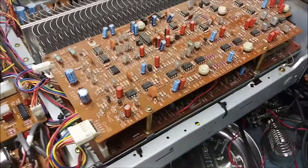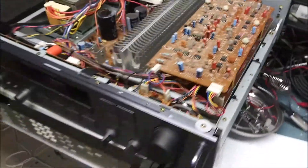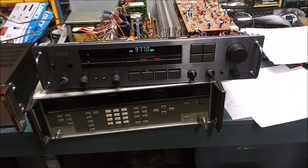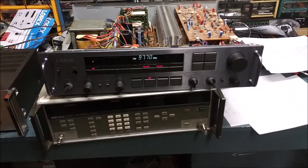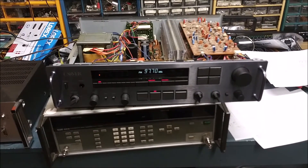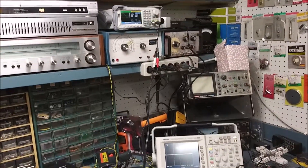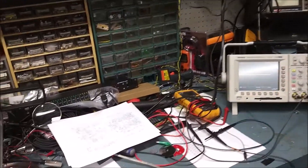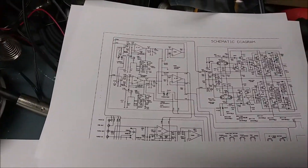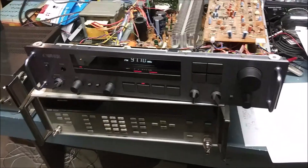There's another circuit board over here — probably parts of the tuner — and another one underneath with preamp stuff. The customer is saying it works in mono but not stereo, and there's also a ground hum. That's what we're looking at today. I've got a signal generator and an oscilloscope, and we'll signal trace through it using sections of the schematic I've printed out.